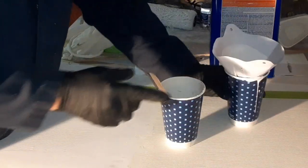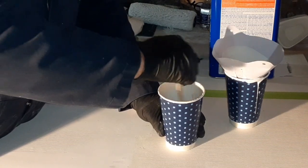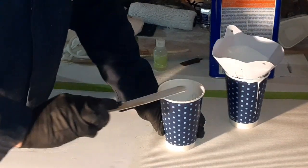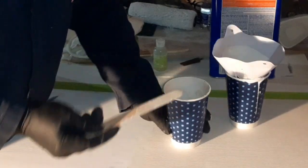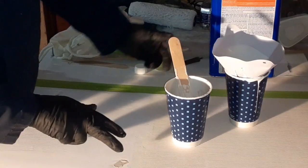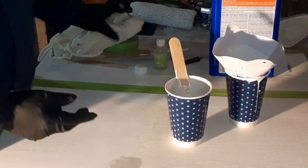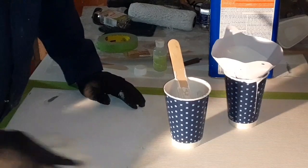I've never gone 2% when mixing MEKP with any of my gel coat. My preference, even in the summertime or wintertime, is for my gel coat to cure slowly. It has a crystalline effect — if you look at crystals formed by cooling quickly, they are short and fragile. Ones that cool slowly are your longer and stronger crystals. This plastic you're curing in the gel coat is going to be about the same. There's a little difference in shade there, and a lot of it is due to age, but I'm going to lighten this up just a little more.